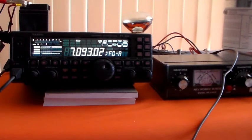So if the radio will run 100 watts peak SSB, and it will run 100 watts FM, it will only run 25 watts AM. You see, some of the radios will produce a bit more carrier. They'll set the carrier power to 30%, but what happens then is the modulation becomes quieter. You're not getting the depth of modulation. Because the difference in signal strength between 25 watts and 30 watts would be absolutely nothing at the receive end, it's much better to run it at the 25%, around 25 watts, so the modulation is far more incremental, so it will be a louder signal.